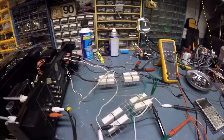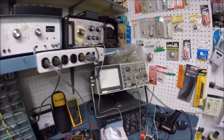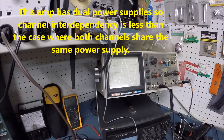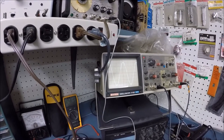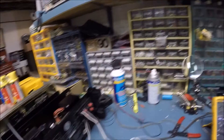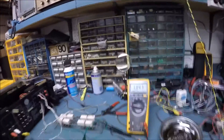Looking at the other channel with both channels driven, I can smell the resistors heating up. That channel isn't flat-topping as much but is doing something slightly strange — there could be a weak capacitor somewhere. Still, the sine wave is pretty clean up to about the same voltage level, so this thing is definitely working well enough. That's at one kilohertz — now we're going to try it at some other frequencies.